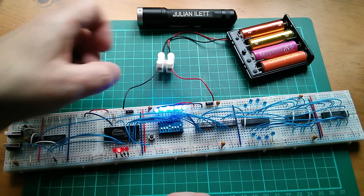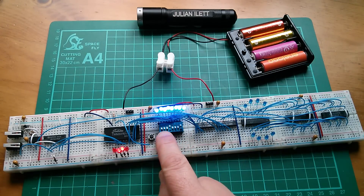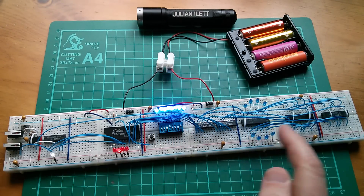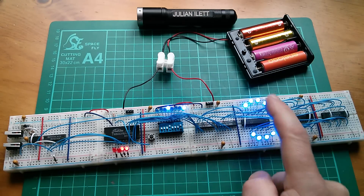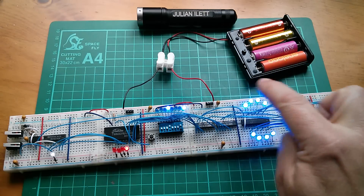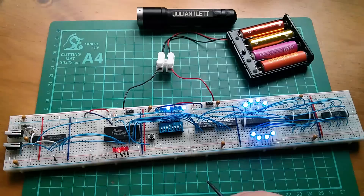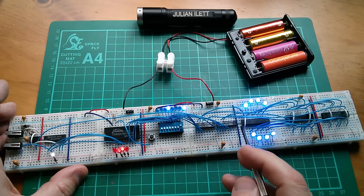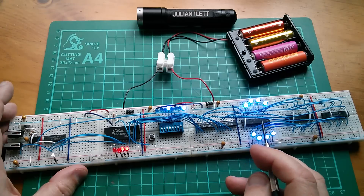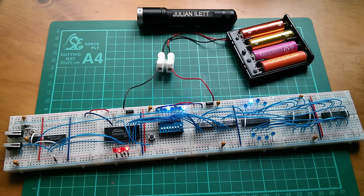Let me put that in the right hole. OK, that's lost my program, but it's easy to restore. I'm going to go for read one and write one — just fill the memory with that. We've also lost the data that was in there, so although it's rotating, you can't see it rotating because all the bits are high. There's a quick fix for this: read zero, write one — we'll pull in the constant that's in this buffer, and blip that in on one instruction. And away we go.